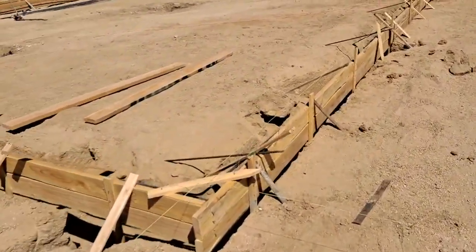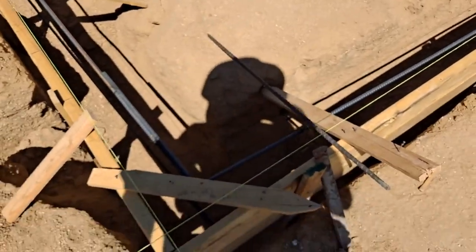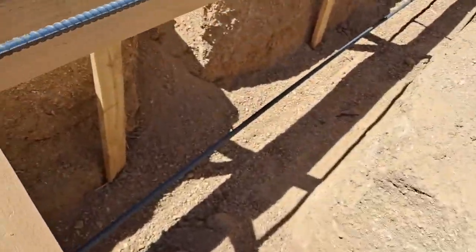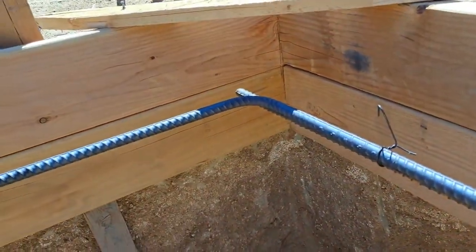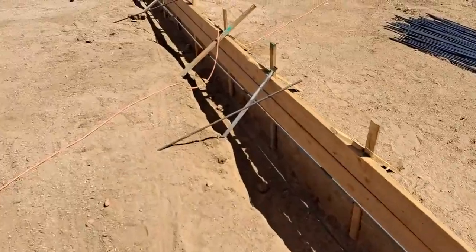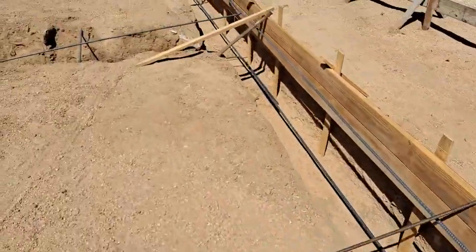Here's the update — got some rebar hung here, this is a lot of the rebar for across the slab. This is 3/8 inch diameter rebar, but this stuff here is half-inch rebar, bigger rebar. Got these corners made up; it basically hangs off the ground. The upper rebar is all for the footing, so the full perimeter is all rebar in there, hung and tied together, with bends in it for reinforcement. It goes all the way around.